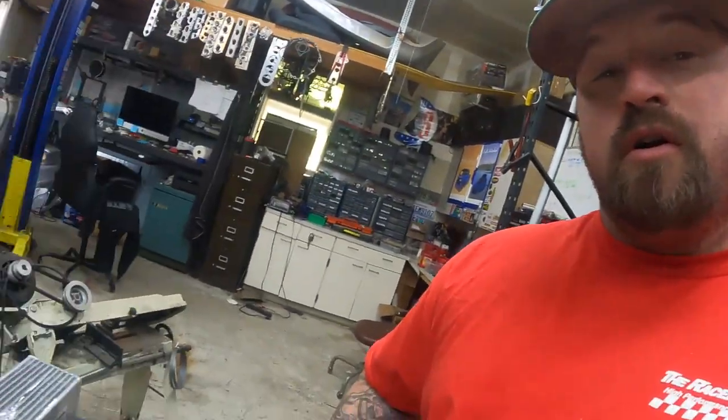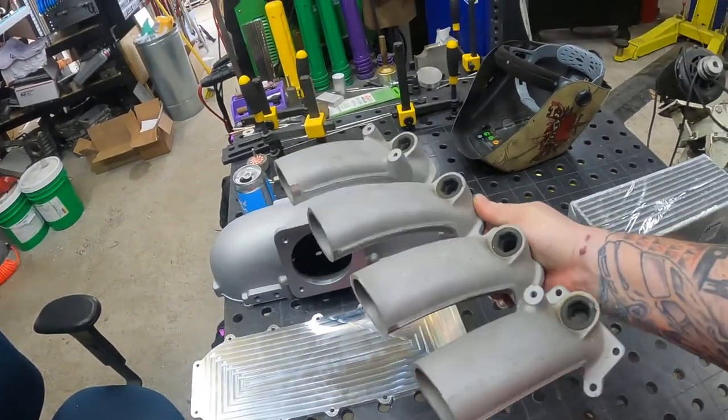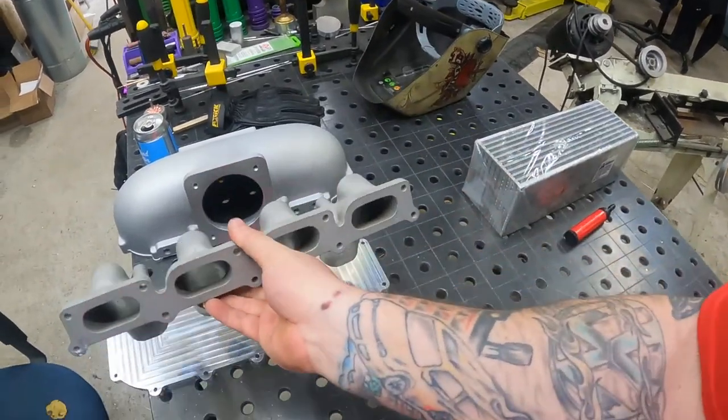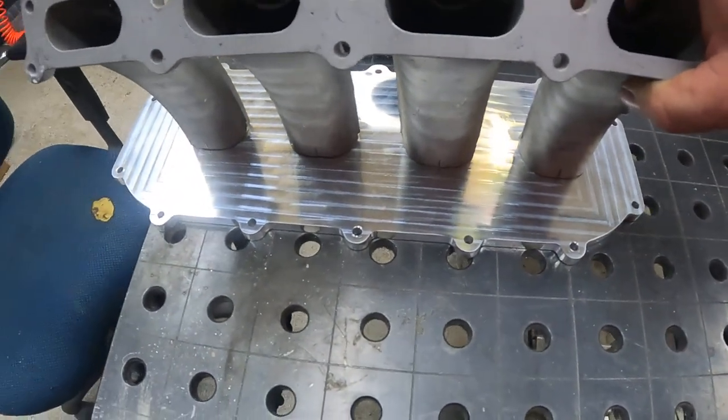But what this is going to do is allow you, this is a poor example because this is 20 valve, but this could be any make or manufacturer. You can lop off whatever section you want. You could put it on a blank plate. You can trace out the holes, cut them out, weld that bad boy up, port it out however you want, use a router. Man, I was doing all kinds of crazy stuff 15 years ago, using a wood router on a bench. If you want to do it, you can do it. You just got to make it happen, and you don't need a fancy CNC machine. You don't have to have that.